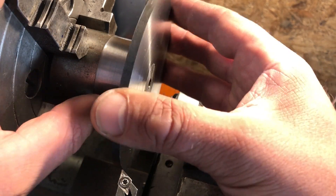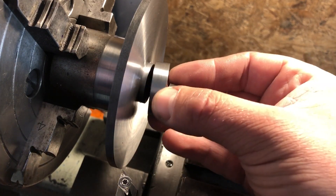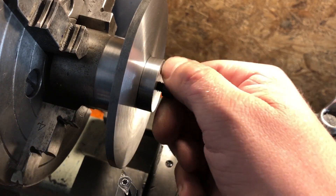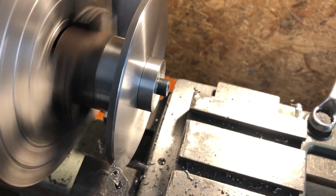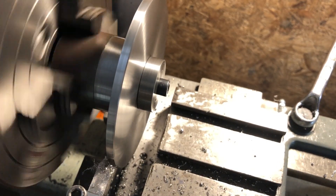To machine this, I have again made a mandrel in place, with a sleeved clamp, that should hold these firmly enough. Thinking ahead a little, I have also machined a short section back from the shoulder to a nominal size, as I think I can use this mandrel again when drilling the plates. A skim off the factory surface, and a chamfer on both sides, completes the turning work.